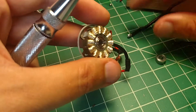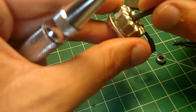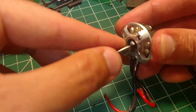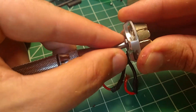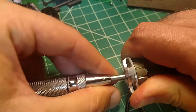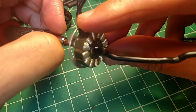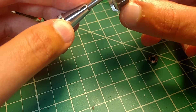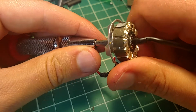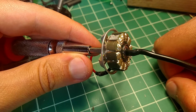Generally bearings don't come out that easily. So, we put the wire through the center of the bearing, then we try to stick the center punch through the center of the bearing. These two things together cannot fit. So you then press, spring action builds up, and it pushes. Right now the bearing has not moved at all, but if we do this a few more times, you can see the bearing is starting to work its way out. Every time the hammering action goes off, the bearing moves a little bit more.